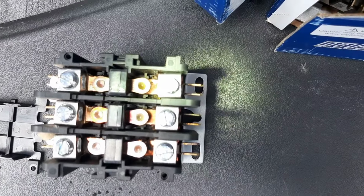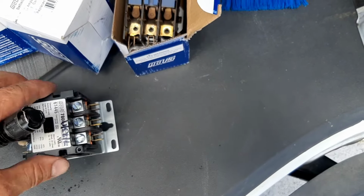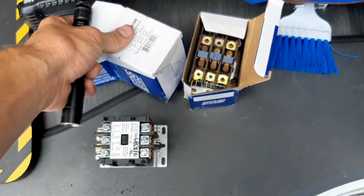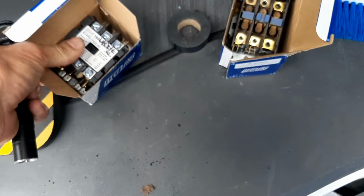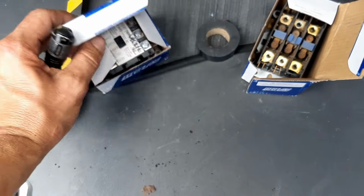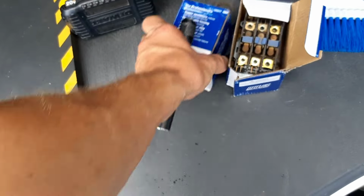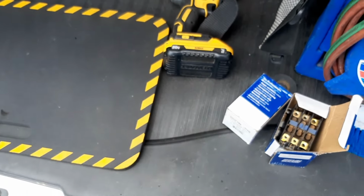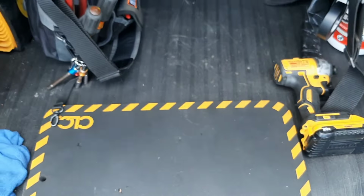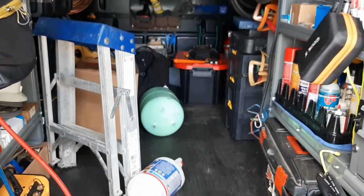So, changed the contactor. It was just one leg not making contact, but after changing the contactor, everything runs. Condenser fan motor amps are up slightly, about 1 amp over its rating. We're gonna clean the condenser coil, see if that helps, and just kind of go from there. We probably need to come back and clean the other one. Filters are dirty, all the usual stuff inside, belt's loose. But I got a maintenance guy with me now, so I'm gonna leave it at that. I was hoping this would be a little bit longer or maybe a little bit better, but you know what? It is what it is.